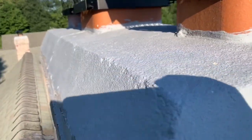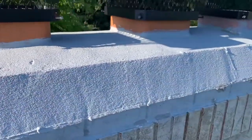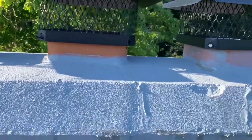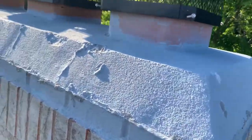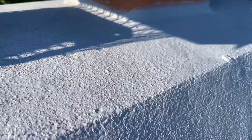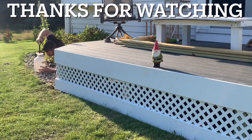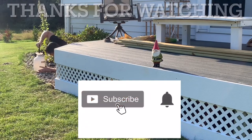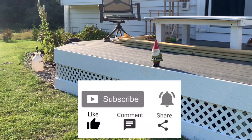It's a relatively inexpensive solution to extend the life of your chimney and to prevent or stop leaks. Even if I had a brand new chimney, I would apply these right away. If you have any cracks or gaps, take your time and fill them well before applying the sealants — I kind of rushed it as an afterthought because I was in a hurry. And that wraps it up. As always, thanks for watching, I hope you found this helpful. Subscribe for more how-to and review videos. Drop any comments below, and I'll see you in the next video.